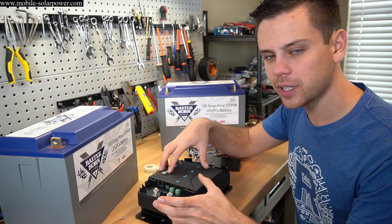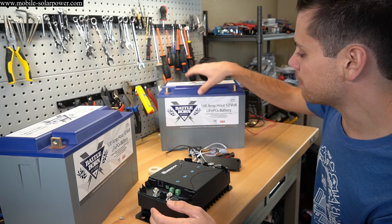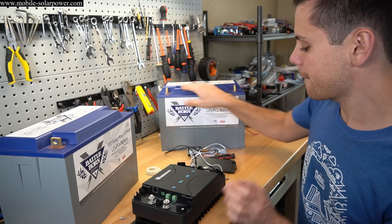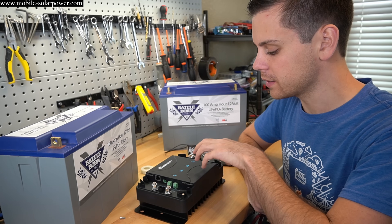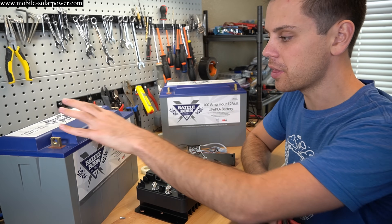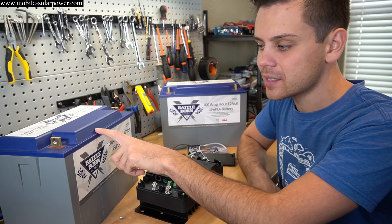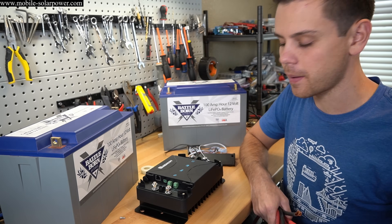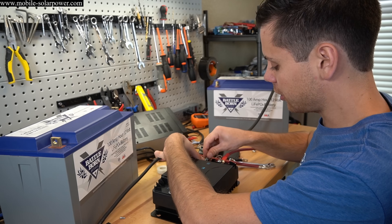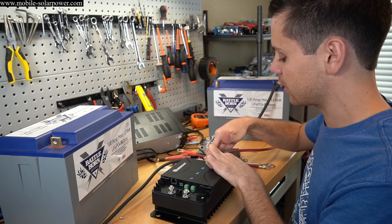Since the whole point of this unit is to charge the solar battery in various ways, we're going to add an amp meter between the Battle Born battery and this unit so we can see how much power is going into it. The number one reason people will mess up when installing this is not using the proper gauge wire at various connection points. These batteries may be far apart, so measure and figure out what size wire you need. For this test I'll be using six and four gauge pure copper welding cable. Something I noticed is that these studs are huge and can accommodate three or four large lugs — which is great.